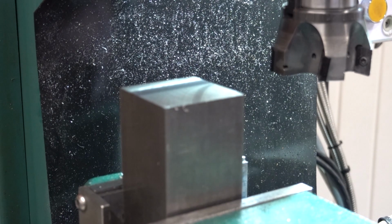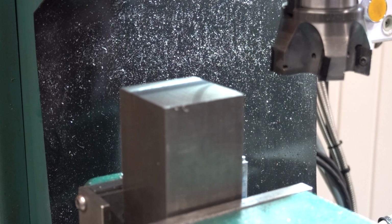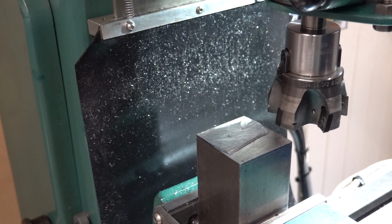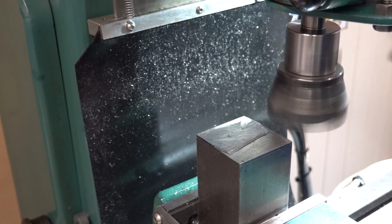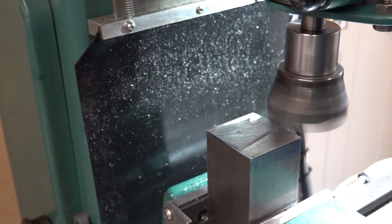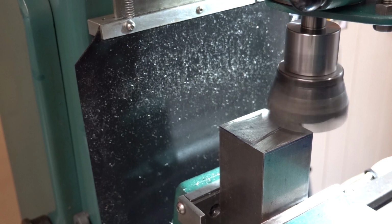Nice finish. So I'm going to flip that over, deburr it, flip it over, and then I can start taking all my material off. But I cut it with a hacksaw and the cut-off machine, etc. So take it gingerly. Got the depth of it. I took one little fine cut, so I've just brought it up 0.15 or 0.145 of a mil.